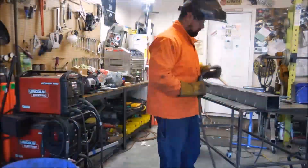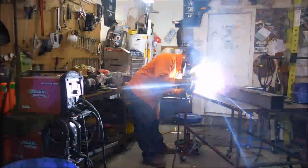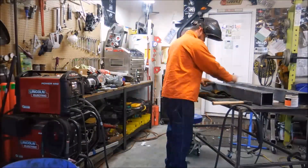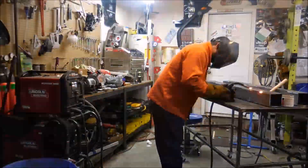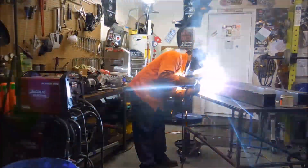So I went a different route and made my own. The material I used was flat bar — 4-inch flat bar with a quarter-inch wall. I tacked it all up, made four outside corner joints, then stitch-welded the whole thing. I was using 0.045 dual shield flux core made by Blue Demon.